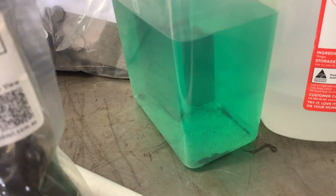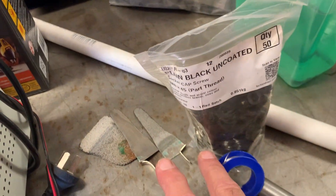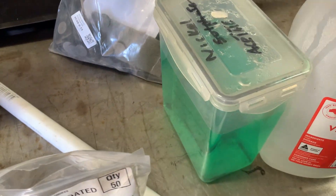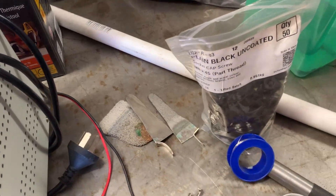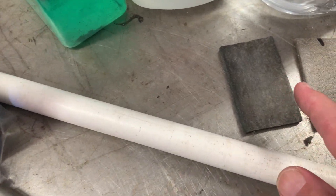You want something like that color. It doesn't have to be too strong. Once you've got that made, I run two electrodes — I put one on this side and one on that side. Both of those electrodes go to the positive power source of your device, and the piece you want to nickel plate is on the negative side.